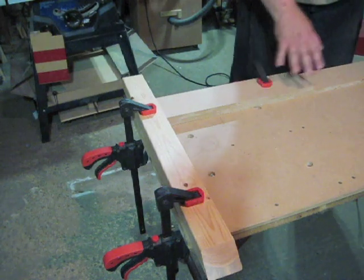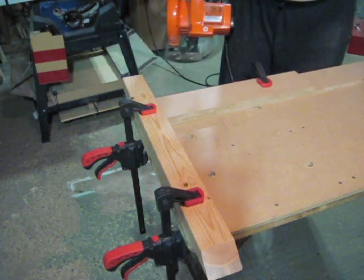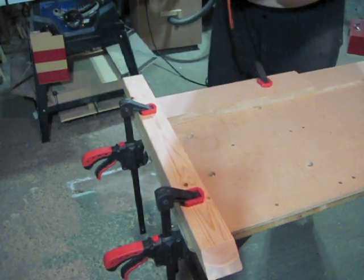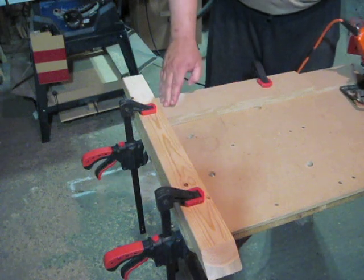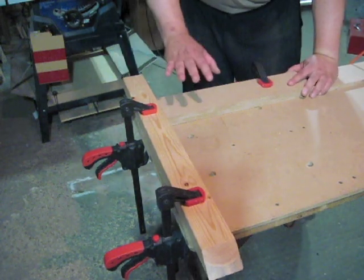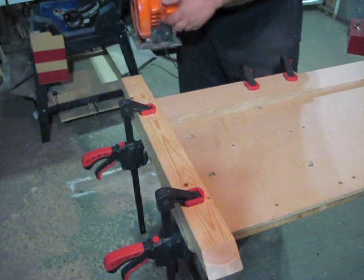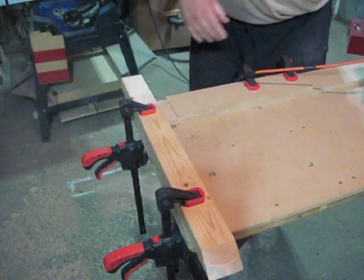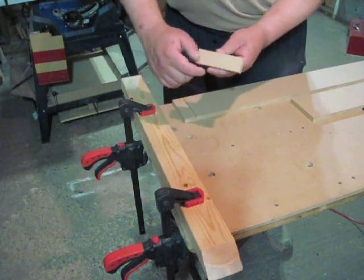The reason these needed to be fairly long is they have to be long enough that I can put the clamps where they're not going to interfere with the saw. Once I have it all clamped down, I'm going to make a cut straight across. I've set the blade to a height of about 5/8 of an inch, so it's going to cut right through the top piece and make a score line in the bottom piece. I've got it all lined up and tight, so I'll make the cut. The top board was cut right through, giving me a little strip, which I'm going to cut in half to have two blocks.